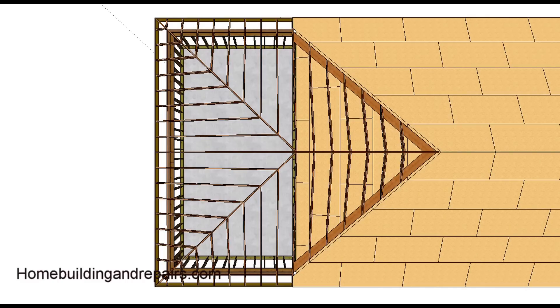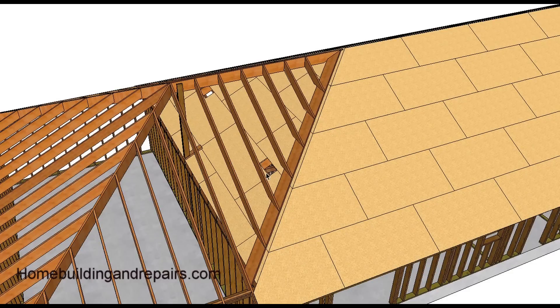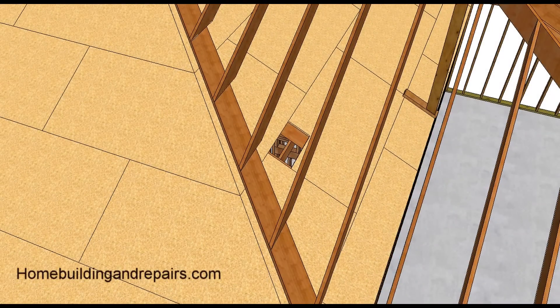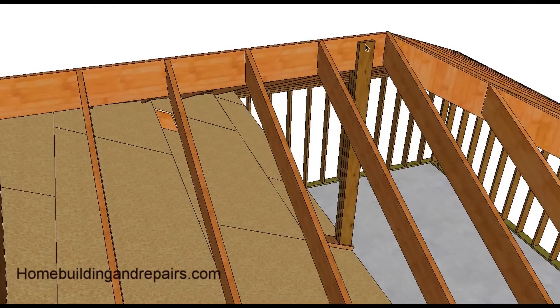When you install a roof over an existing roof you need to have some type of ventilation holes. This allows air to travel through the framing. You won't need these if you have enough ventilation already, but I like to have cross ventilation. Sometimes you're allowed to cut a 15-inch by 15-inch hole — you would probably need to contact your engineer for more information to find out the maximum size or how many you could put in.